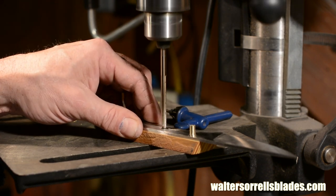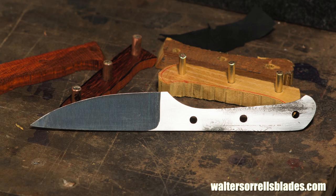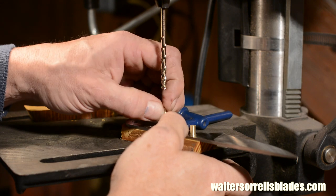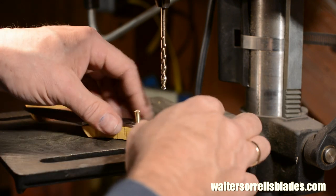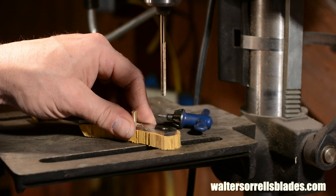I'm actually drilling a hole, then inserting a pin, then drilling the next one, assuring that nothing gets out of whack. I'll show a totally different method of getting your tang holes lined up in my next paring knife video. That method will drill the whole shebang at one throw — the tang and the scales — but to do it that way requires some upfront work making a jig. More about that in the next video.